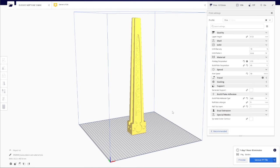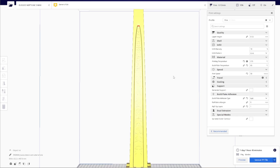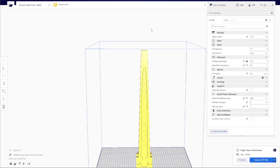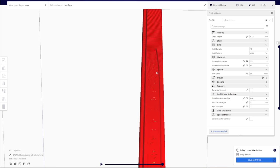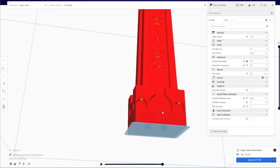I am pretty blessed to have a rather large 3D printer. My Elegoo Neptune 3 Max is the only printer tall enough to do this in one shot. My M4 and CR 10 max are only 450 millimeters, but the Neptune 3 Max is 500 millimeters tall so it can just barely fit the Suba. I could tilt it or cut it up — he included cut-up files — but I wanted to one-shot this. Since it's so tall, I have to print it really slow because as it gets to the top, it's going to get wobbly. I didn't use any supports and it came out perfect.